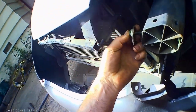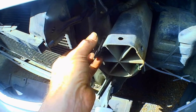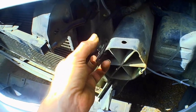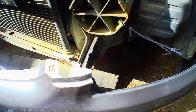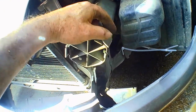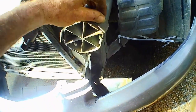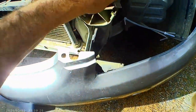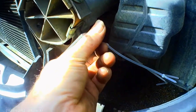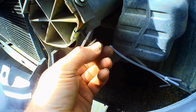Here you'll see me putting them on. I put the clip nut in and used 3 clip nuts. It turns out these bolts each have a proof load of somewhere around 4,000 pounds, so they're more than adequate with just two — I could have left the caps on, but I didn't know that. I ended up using 3 bolts on each side to hold the bar I was making up. I'm making up the bar by putting tabs on, holding them in place, taking a flat bar, holding it with magnets, tack welding it, and cooling it with water. I did this on both sides and put the flat bar.